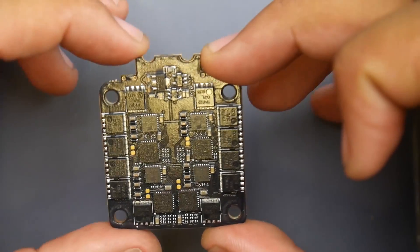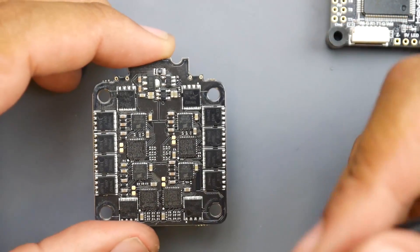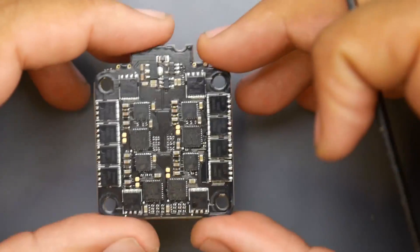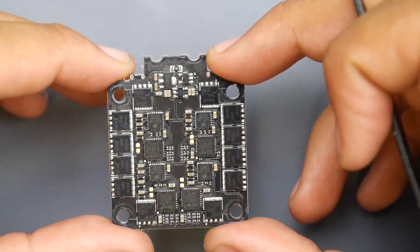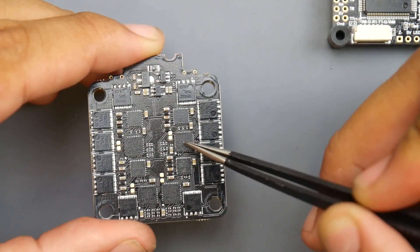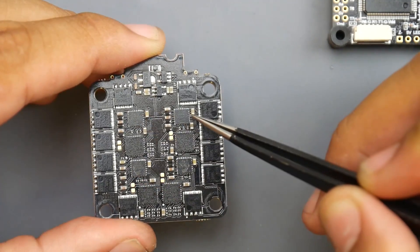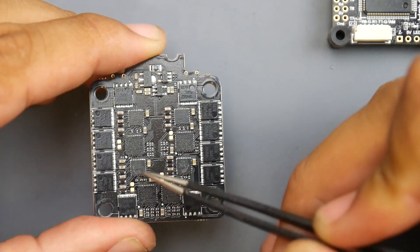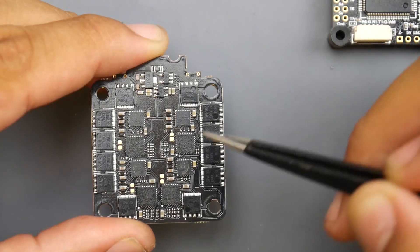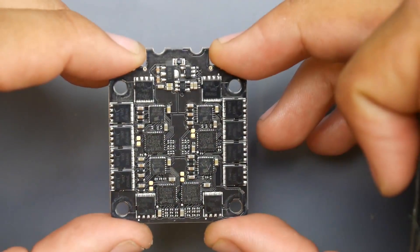If we flip it onto the other side, we notice it's rocking F3 ESCs, meaning they're using an F3 microcontroller unit, which is a lot faster than the F1 and also the BB2 chips found on BLHeli S ESCs — the latest and greatest, and should be future-proof for quite some time. The microcontroller unit is basically the brain of the ESC, and we have four of them here. These big chips are the MOSFET drivers, and here we have the F3 chips — those are the brains. What I tend to notice on ESC noise testing is that the higher the clock speed of the CPU usually turns out to be cleaner, so I really can't wait to get this tested.